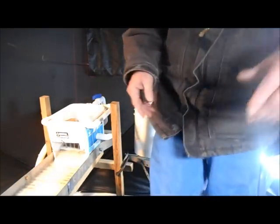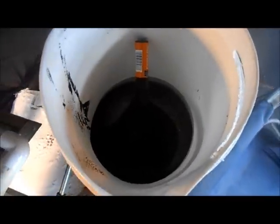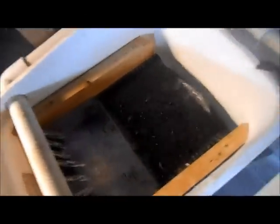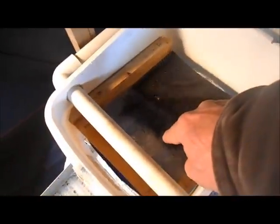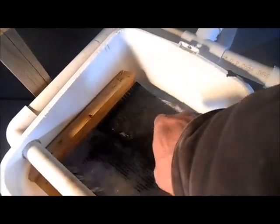Just a kind of mock-up run — I'll get the camera and show you what we're doing. There are the concentrates I'm running; not a ton, but if I could get it down to a couple cups that would be pretty sweet. There's my little hopper that I made where we'll feed in the concentrates. I've got some deep-V silicone matting at the top, some sawtooth matting down below, and then my little hopper. We've got a couple hundred gallons per hour going down here, and then we add more flow about a quarter of the way down, and then full strength at the end.